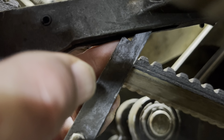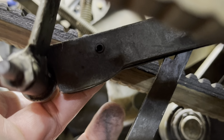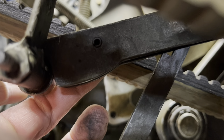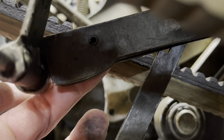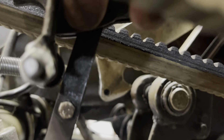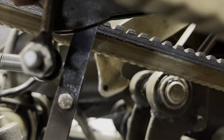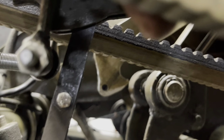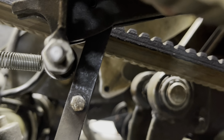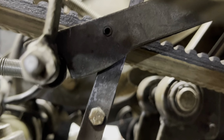But you want to make sure that's in good shape, a good 90 degrees. Make sure you've got a roll pin in there, not a pin with an X washer, because that'll cause it not to catch. Check that out. When you're done, you want to have this guy level. And then you're going to have your little roller right underneath it. It's got a spring pulling forward on it. But as soon as that pin goes over, you don't want a whole lot of clearance right here. As soon as that pin goes over, it's going to push that out of the way, drop that guy down, and latch. That's how your pin gate works.